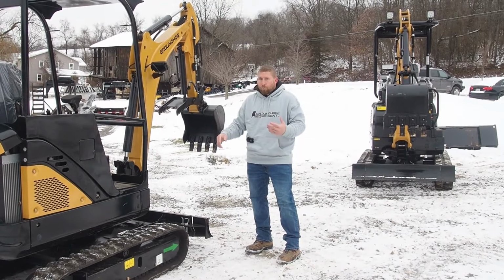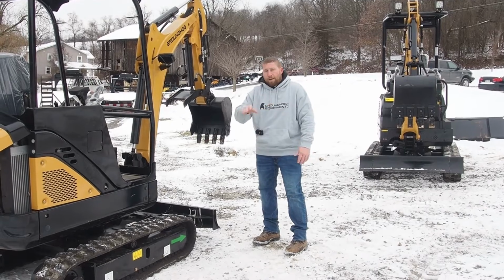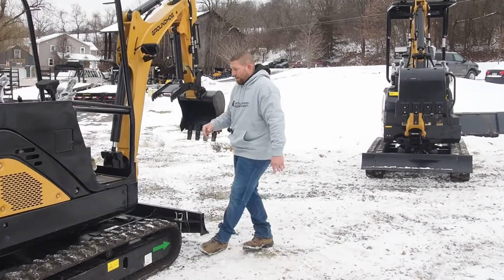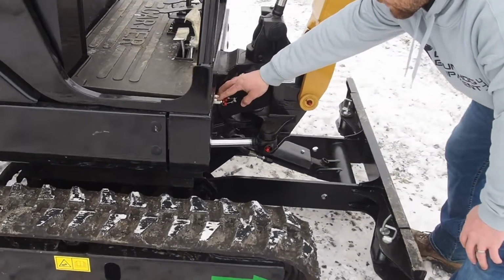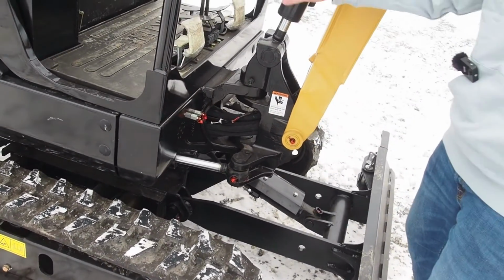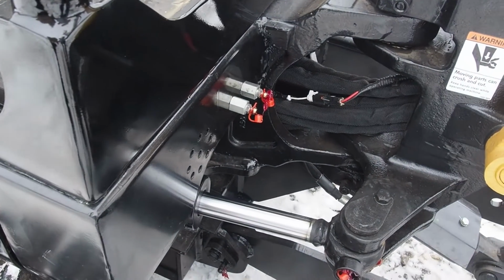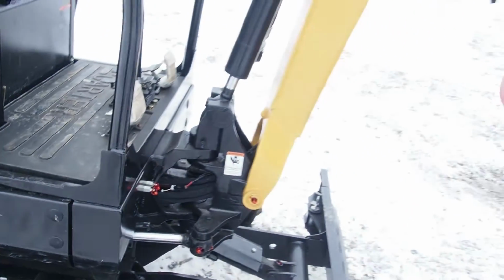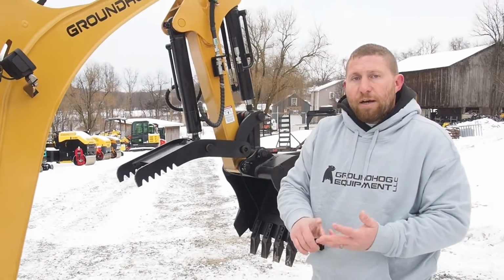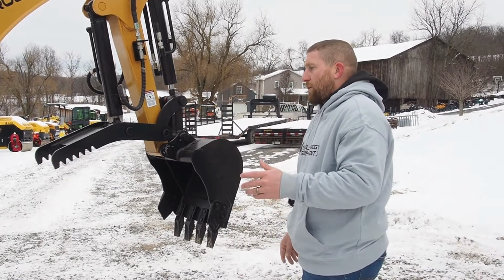Make sure you're greasing all your grease points. You got 2 to 3 grease fittings on the front of your machines or the side of your machine, depending if it's a small unit or big unit. And this one is right here. What they're doing is running around a tube back to your slew gear, and it's going to grease your slew gear, and you're going to be greasing the back of your side swing motor, your side swing cylinder, or your guide gear, your slew gear, and your side swing. So again, it's 2 or 3, and that's the difference from one to the other.